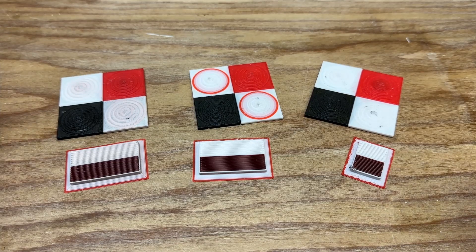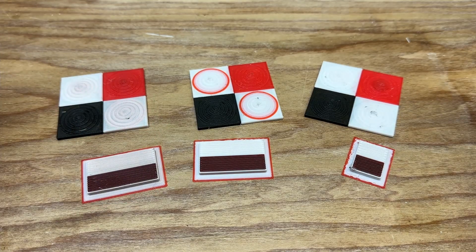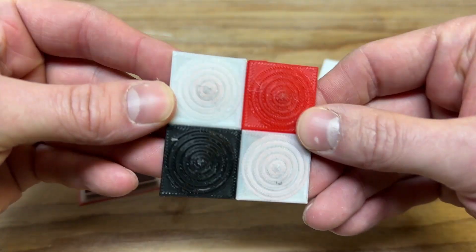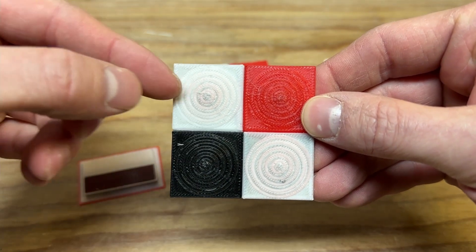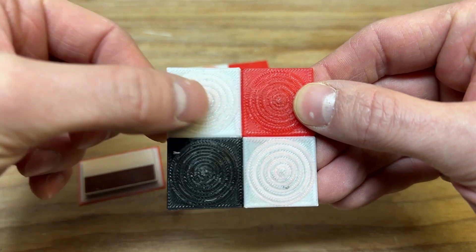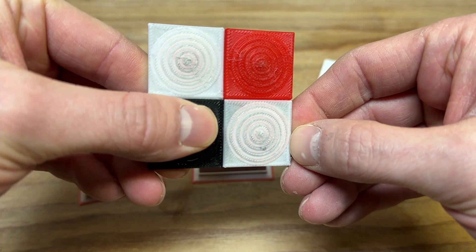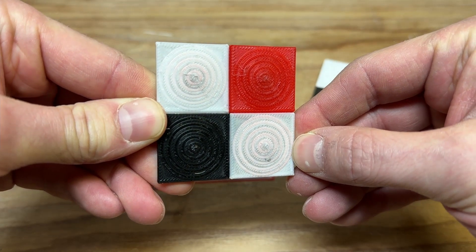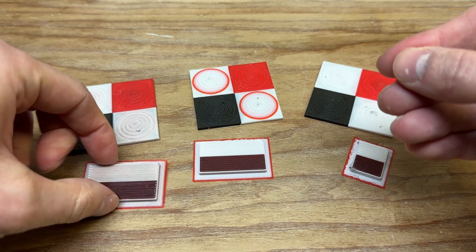This is a quick video to look at whether or not prime towers actually matter, as a follow-up to the flushing volumes video I did earlier. This is 0.25 flushing volumes, and you can see that the white is actually pretty muddy. The red and the black alternate through the cone here. That's definitely not a good result at 0.25 — that was with a full prime tower.